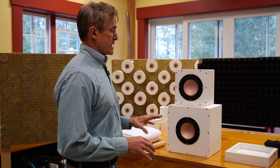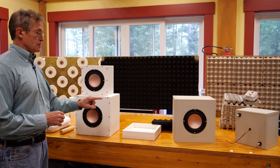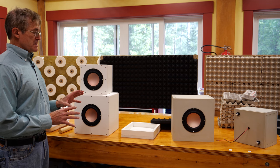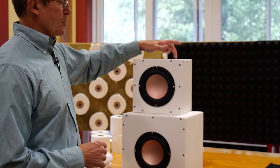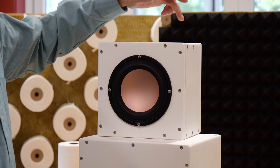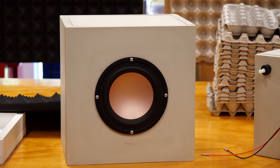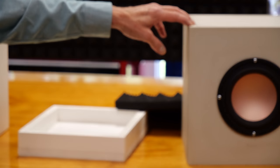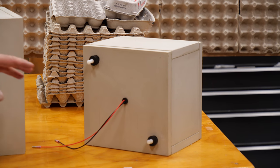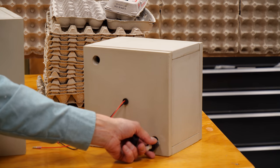To do this test, I constructed four relatively similar speakers based on four identical drivers — relatively low-cost drivers. The enclosure materials differ between the two pairs: one uses soft, inexpensive, rigid PVC foam board, and the other uses fiber reinforced concrete panels that I molded and grouted together. In all cases, I have the ability to do both a sealed design and a ported design, and we're going to look at the effect of that as well.